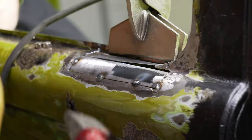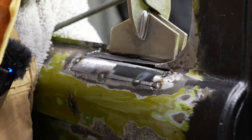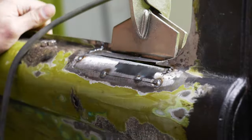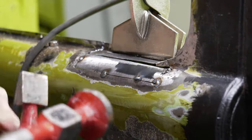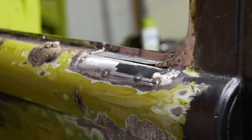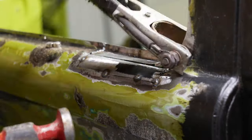Once again for this piece, we will follow the same process of spacing our tacks apart, making sure not to overheat or warp the metal since we have the correct curve and don't want to change it. Then follow that with some finger sanding and a lot of patience, and you'll have the repair that you want.